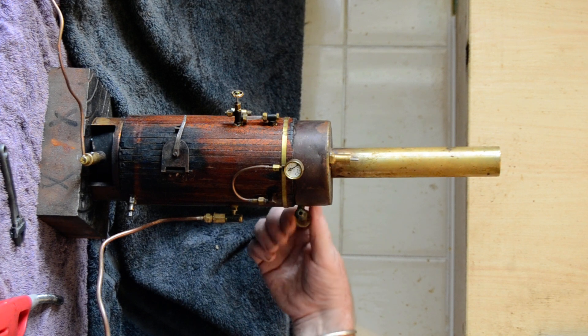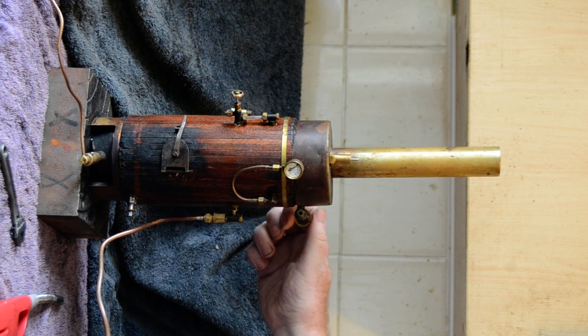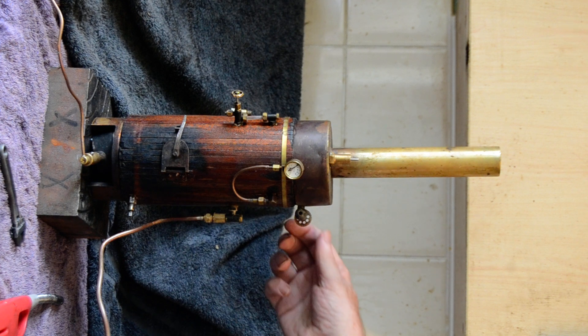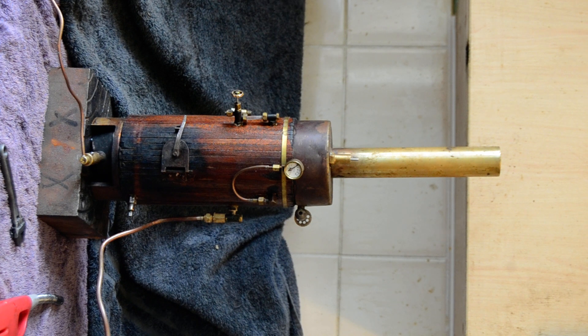You can see it's got a bit of steam now — it would run a small engine now at two and a half minutes. I'll leave the valve shut and wait another minute and we should be getting somewhere. You can probably see the steam coming out the outlet now, and that's not even three minutes. It would probably build pressure better if I repacked that steam outlet — that's something to do before I see Andrew next week. That's at about three minutes.